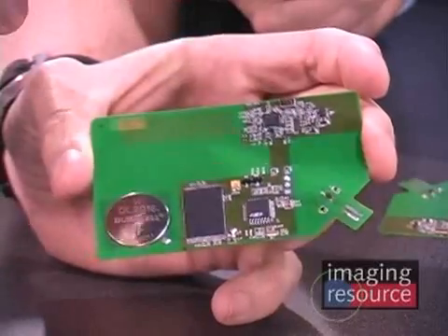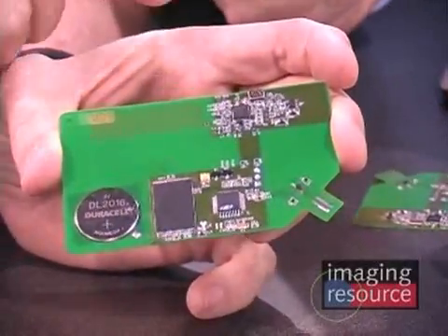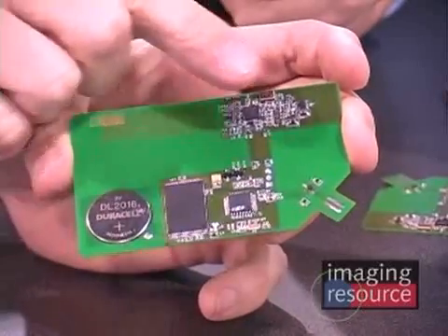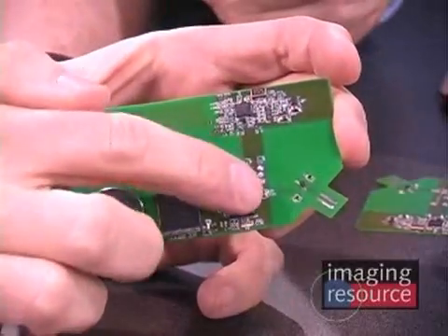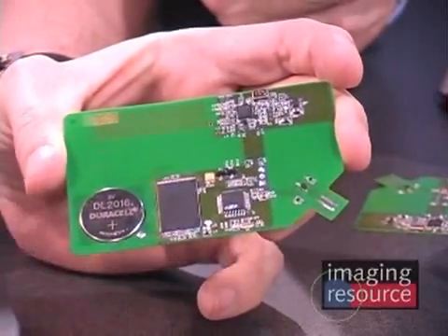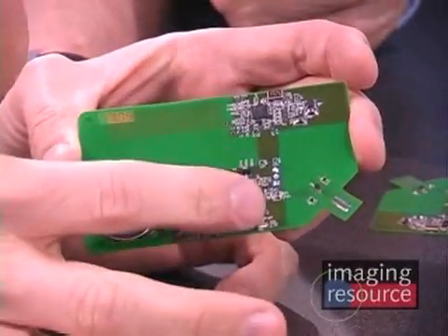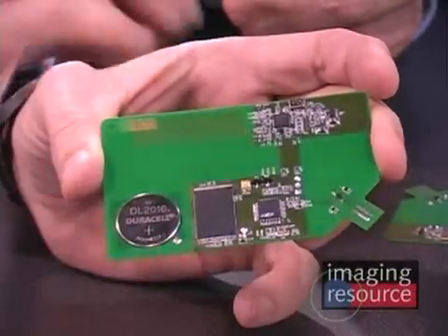Here's the basic system. The main part — the heart of it — is this small GPS radio here and the TCXO crystal that keeps time. When this is turned on, data streams from this through the microcontroller and stored away in the flash. When you come to unload it, the microcontroller then streams the data out from the flash via USB onto your PC.